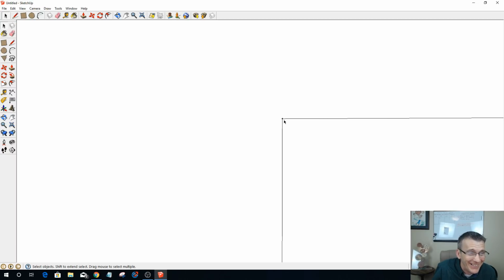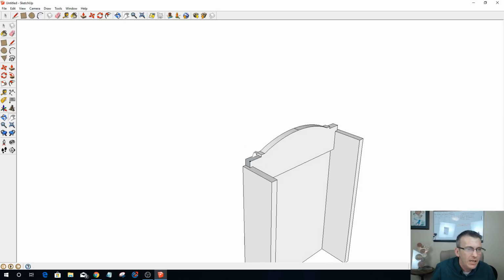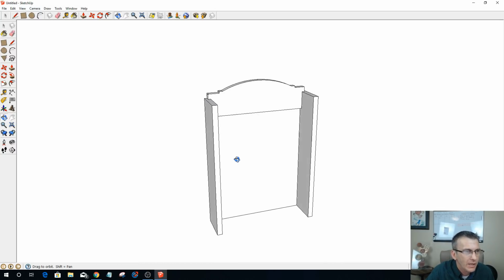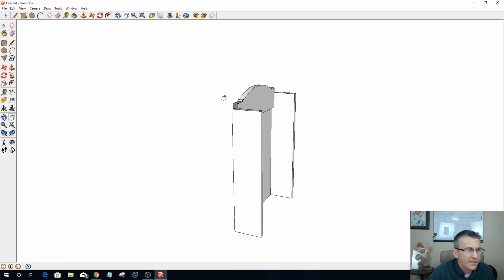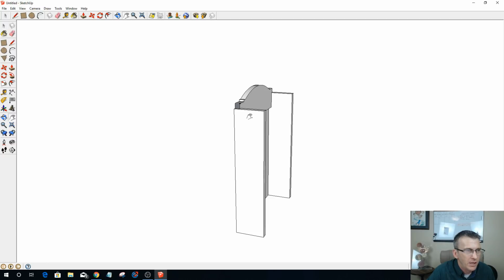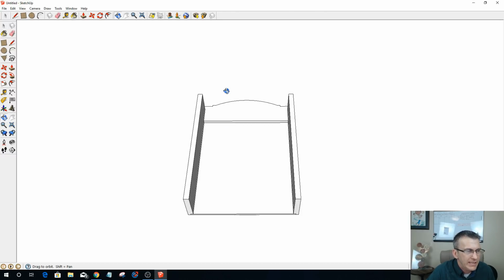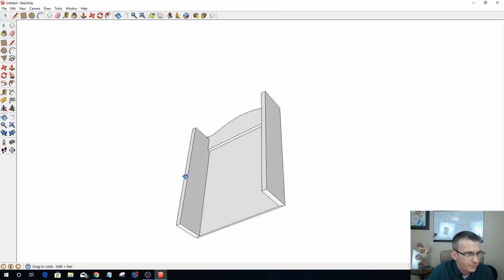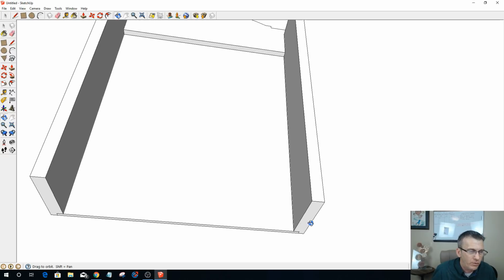All right, he's gonna stay there because he ain't going nowhere. All right, so let's pull this back over. That's gonna be the top of my spice rack, and just something very simple. Now, mind you, my sides here are going to kind of contour into this back here. They're not going to be squared off like they are, but I'm not going to go into all that. I just want to kind of get the basic layout. Now, on my shelves, I'm going to have a bottom shelf that is just literally a rabbet joint in here.